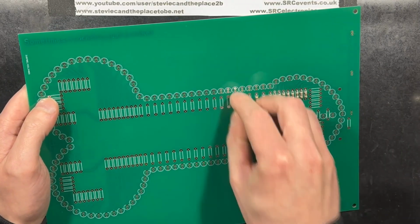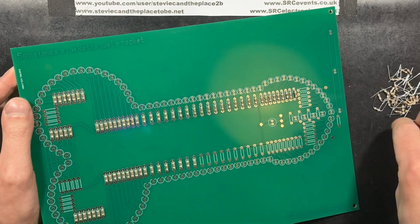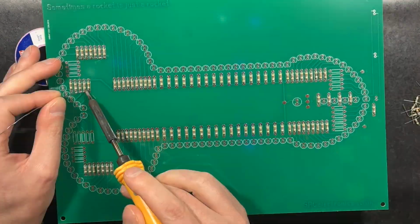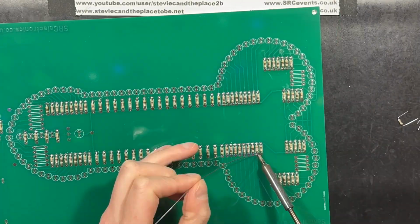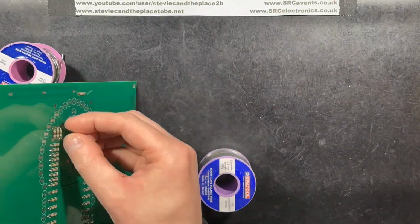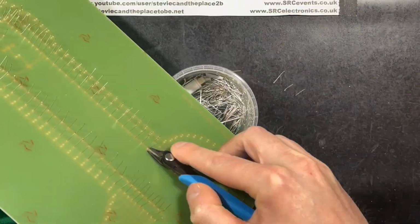Not that this matters, because I'm planning on soldering the resistors on the back, then spray painting the front of the PCB black, and then soldering the LEDs into place. Because I'm soldering the resistors on the side that they're inserted from, I'm using two rolls of solder to prop up the PCB while I do this.